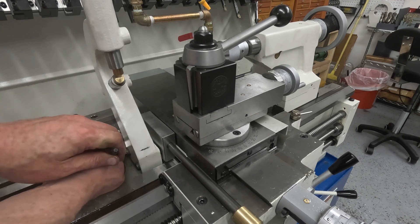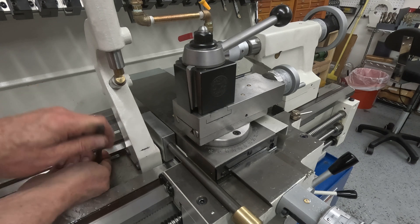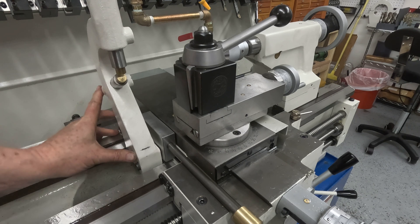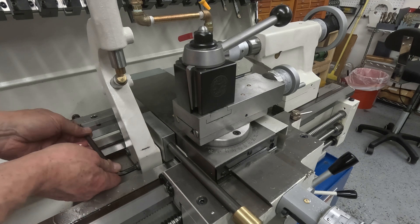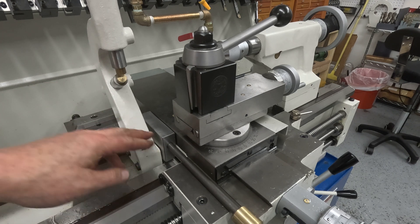This won't be tight because I can't screw the bolts all the way in — I've got to take off about 150 to 200 thou. You can see that's still loose, but just to give you an idea: obviously take off enough and then that head will be sub-flush and then that will be held tight.